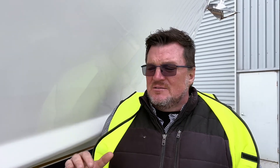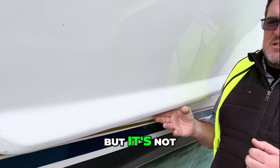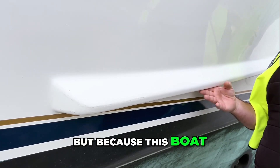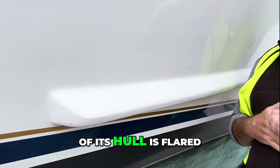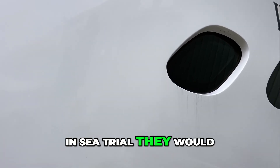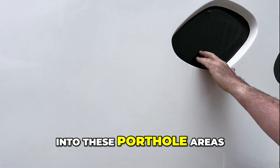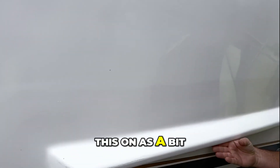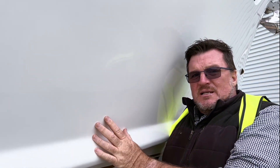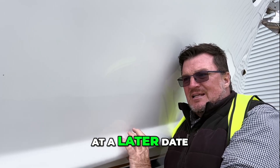What can happen is you can have things added to a hull like this. The first section is a spray deflector — it's like a chine but it's not really an active chine on the boat. The chine should be about here, but because this boat and the shape of its hull is flared and not aggressively flared enough, I think in sea trial they would have found it was throwing water right up the hull into the porthole areas. So they've put this on as a spray deflector to throw water down. Because this boat was made in a single mold, not a split mold, this would have had to have been added and glassed on at a later date.